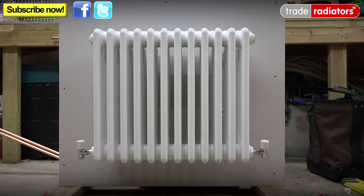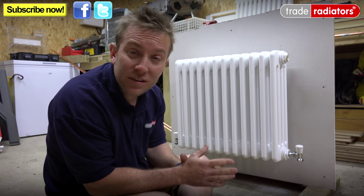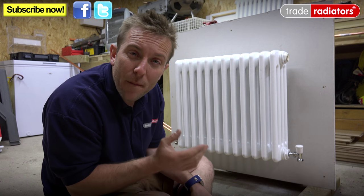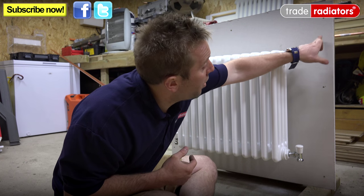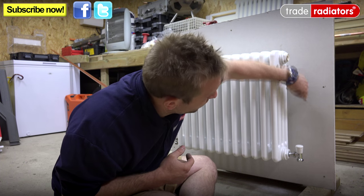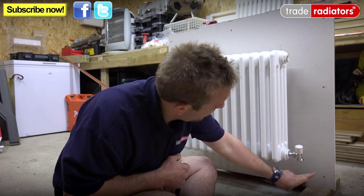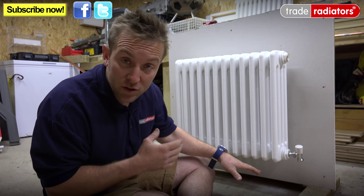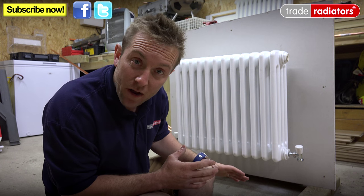So now we've got both our valves on. What I next usually do is mark out where I want my clips to be. The good thing about this is that you've got two pipes sticking down here and you know what those positions are already. If I use a spirit level to run my clips and mark them up, I know that my pipes will automatically be level as well. Remember that your first pipe coming down here on this side will be the one that goes straight into this valve here. The other one is going to go further out and round underneath the radiator and then elbow out with a T for our drain off at the bottom. So I'm going to get my spirit level and get a nice line down here so I know exactly where I'm going to go.